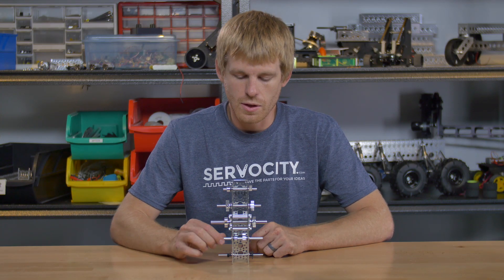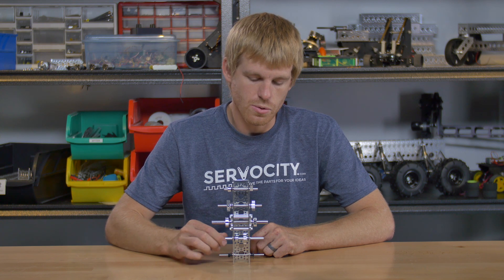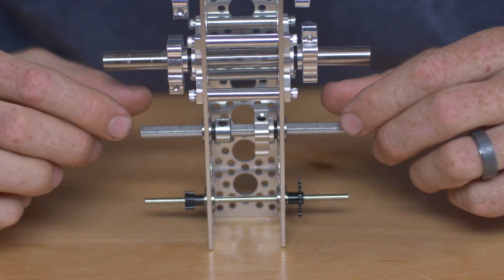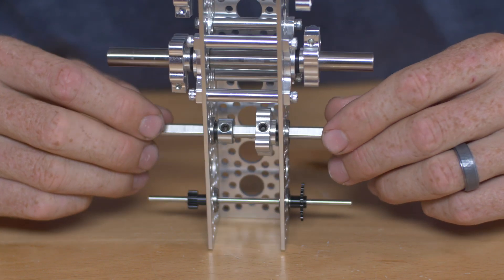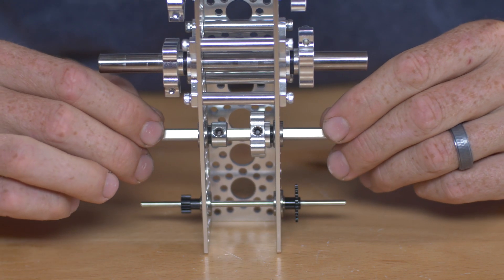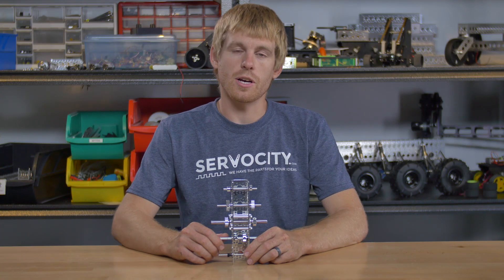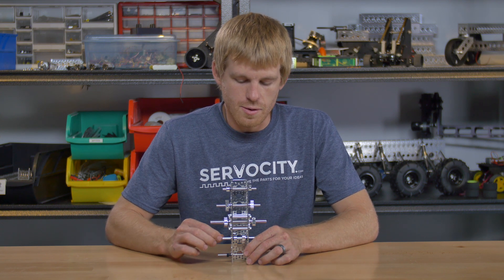On the fourth version, it's somewhat similar to the very first one, in that it's using a quarter inch D-shaft running through the quarter inch by half inch bearings. But the difference is that I have everything internal on this instead of having the collars external. Because I put the collars on the inside, I also put the bearings from the inside going out. So the flange is on the inside of the channel, the bearings are pressed through, and then I have a shaft spacer on each side — on one I've got a set screw collar, on the other one I have a set screw hub. That collar and the hub are pressing out on the shaft spacers, which are pressing on the inner race of the bearings, holding those in place.